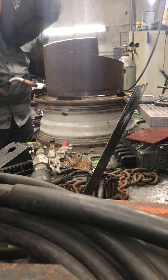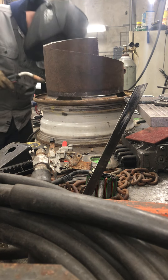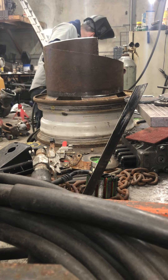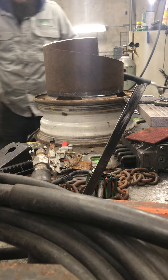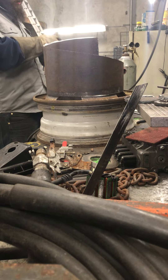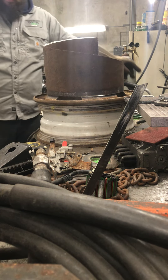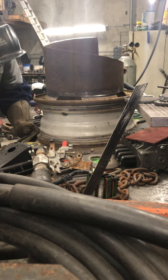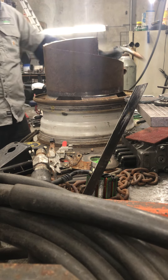Give it a couple of tacks to check it again. If I had a decent ground, it would help — that's just the way it goes. Working old rusty metal, things aren't always grounded the best. I thought I had enough on that nice clean spot where the tire used to be. Maybe not.